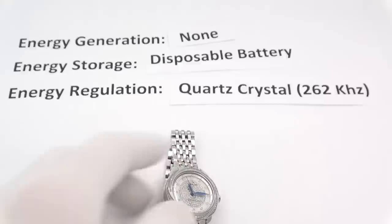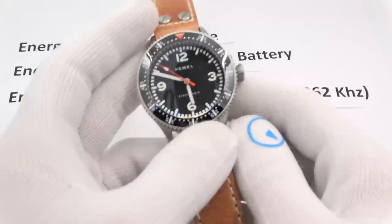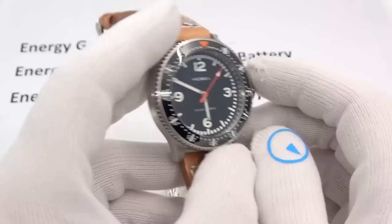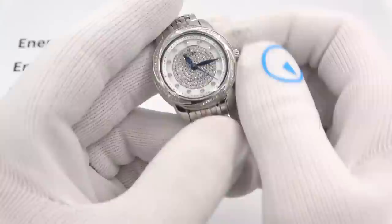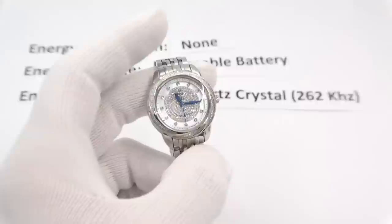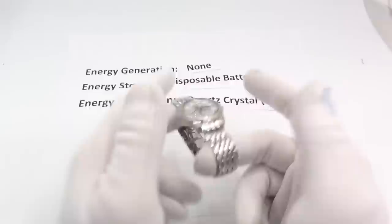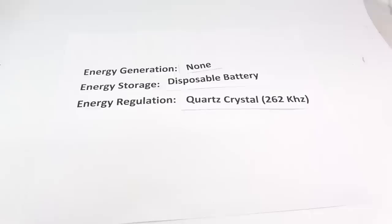To prove that the fluidity of a seconds hand has nothing to do with accuracy: this Hemel Electronic Stratus with a Seiko movement has a regular quartz crystal at 32,768 hertz, yet it ticks three to four times a second smoothly. The fluidity of the seconds hand is related to battery consumption, not accuracy. Bulova could make a Precisionist that ticks once a second and it would still be just as accurate. People confuse smooth hand movement with precision — it has nothing to do with it.